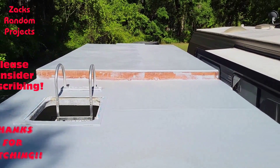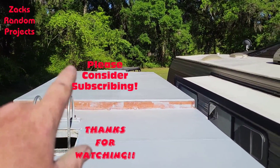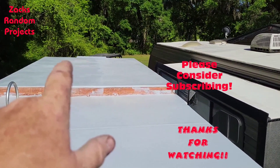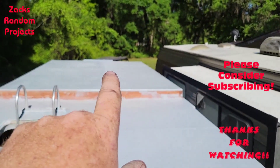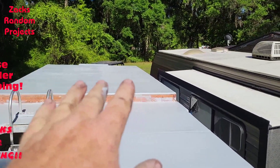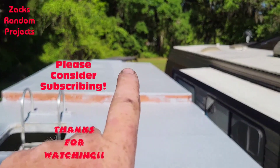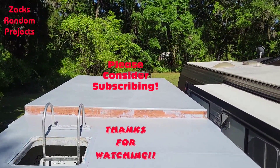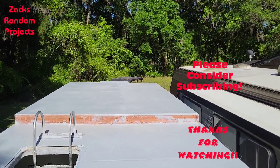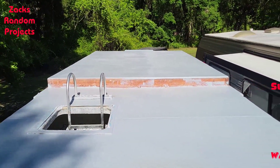Fourth coat done, grip sand put in, everything cleaned up. Didn't turn out too bad, though there are some things I'd change. Rolling sideways you can see where the new gel coat meets the gel coat from earlier today — in hindsight I should have done one roll front to back where they meet for a smoother transition. Also should have had a bigger piece of cardboard under the bucket to avoid the little drip marks, but I can sand those out. Overall I'm happy with it. Fixing to go inside, take a shower, and have a frosty adult beverage. Appreciate y'all hanging out with me.